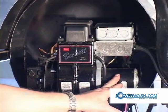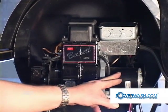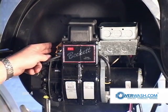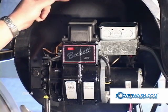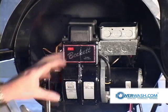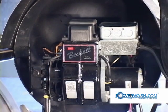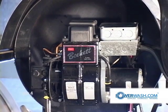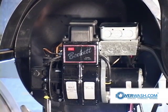Your air comes from your blower motor turning, which also turns your fuel pump that supplies the fuel, and the spark comes from your igniter. All these things have to be operating for any heat to come out of your burner. It's just enough for you to know these individual components so that you can troubleshoot and maintain.